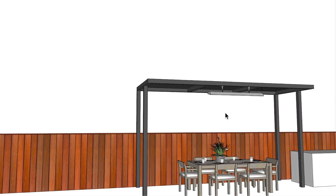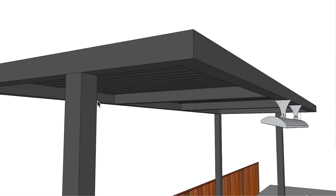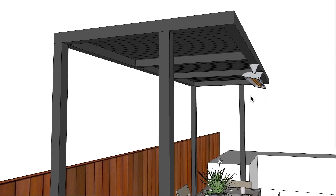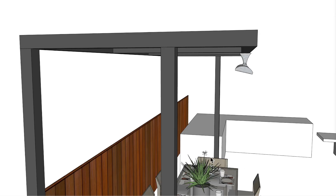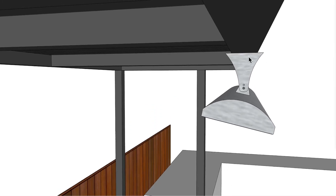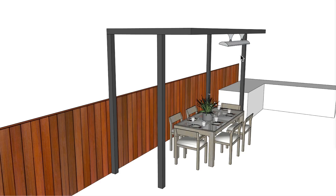One option would be to place one heater. One more thing I wanted to mention is that I made the structure pieces here four inches by four inches tall — all of the different pieces are four by four as far as the frame is concerned. This is a CD 6024, 6000 watt, 240 volt. I have this at an angle of 12 degrees from straight down — 12 degrees up. The mounting bracket itself is six inches wide, so if it's a four-inch frame, it's not going to fit. You might have to cut these edges off or make your own attachment to make it look more appropriate.